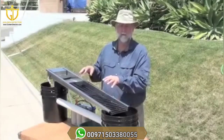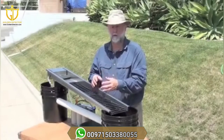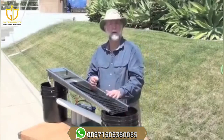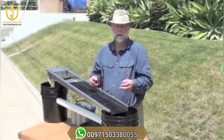A little bit about the use. We started to use this as a cleanup device for all of our other operations. We've used this up on the Yuba River to clean up dredge concentrates — we can clean up two six-inch dredges in an evening. Running the fines through here works really nicely. We use it out in the desert to clean up after our dry washer runs. When we're dealing with really fine gold from Nome, we classify down to about a number eight screen. In the desert we use a number four screen, because there's just not as much super fine gold out there. We've also been seeing it used as a redundant recovery device for people running hard rock, using it as the last thing to test their tailings and make sure everything is being caught.